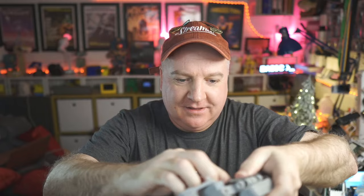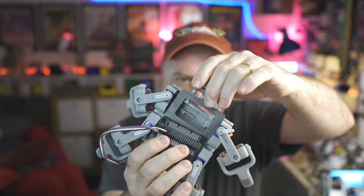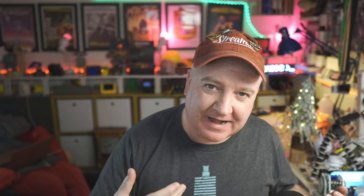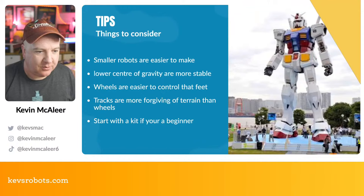I've got another robot here with another Kitronics board — it's a quad walking robot for the BBC micro:bit. It has four legs; each leg has two servos, one for moving side to side and one for up and down. The micro:bit sits in there and we can power it with a LiPo battery via micro:bit's nice JST-PH connector. If you're starting out, consider a kit first to get an idea of how robots work, then move on to building your own.